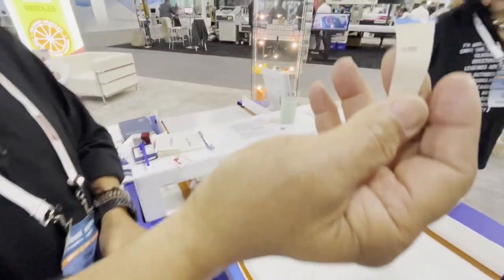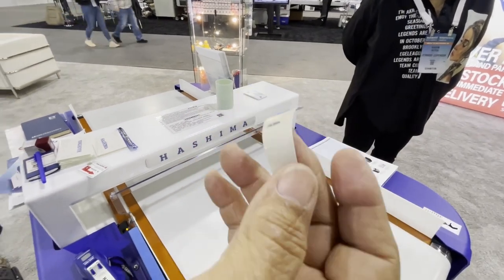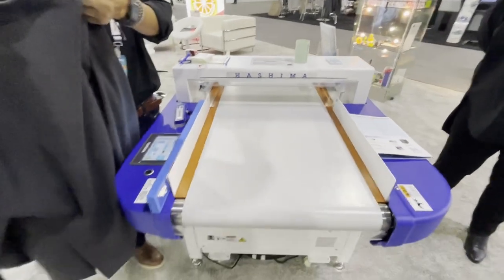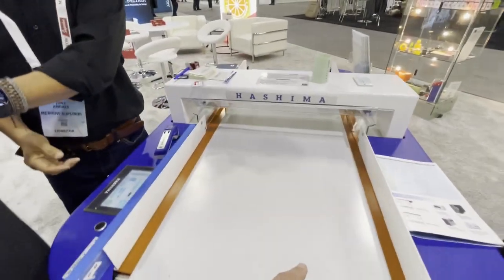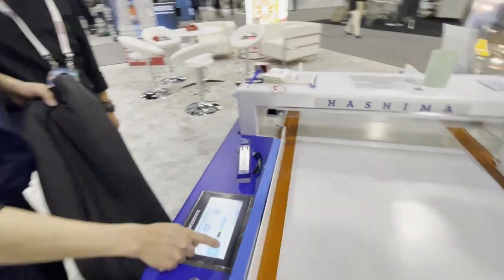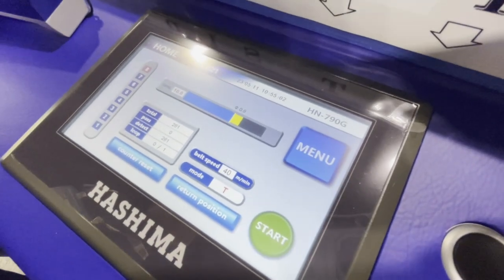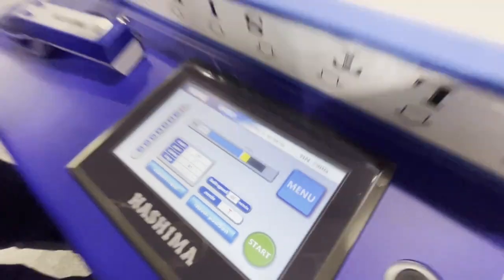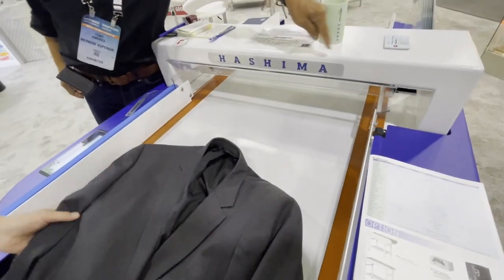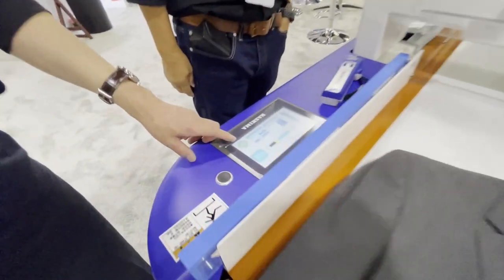Here's the sample — the broken needle. That's the point of the needle. We'll put it in the garment and then detect it. The model number is HN 790G — it's a conveyor type. This bridge is the detecting unit and there are four lines of detectors. All right, let's start.